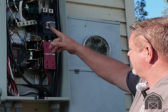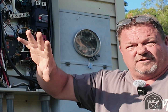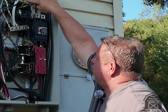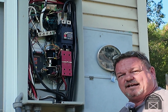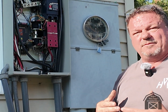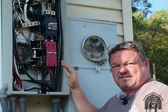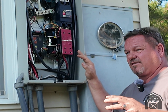Once the timer shuts off it kills the signal, the generator thinks power's back on and shuts off. Or if the solar goes completely offline — not from low batteries but from some kind of malfunction — this will drop out. When it drops out, the generator sees there's no power coming from utility because the solar replaces the utility in the switch. The generator starts, pulls its transfer switch over, and ties into the mains of the house. So either way — whether the batteries get low or the solar dies — the generator knows which way to go and which one to pick.